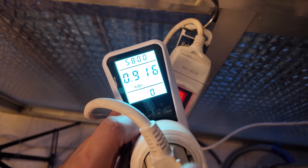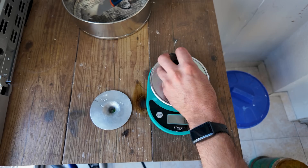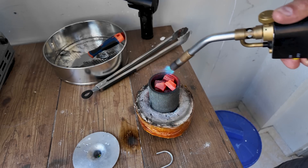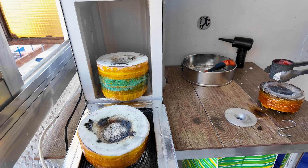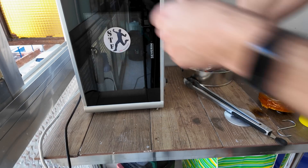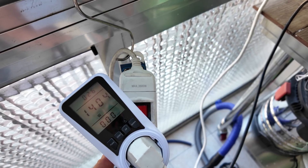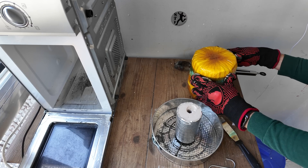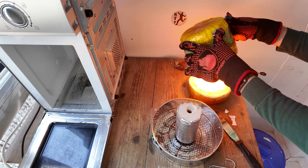Later that evening I finished the burnout. The total time the microwave ran was 58 minutes, or 0.91 kilowatt hours. The next morning the microwave is cold and it's not as warm today — that's a plus. I'm going to melt 406 grams of cast iron. Whenever I melt iron I like to heat the metal with a blowtorch first — it makes the melting process much quicker and easier on the chamber. It was drawing 1403 watts.